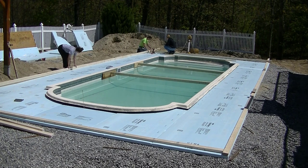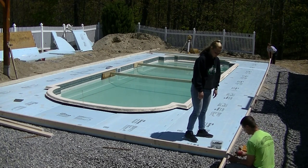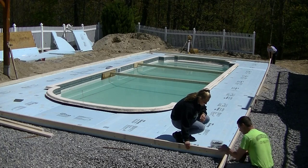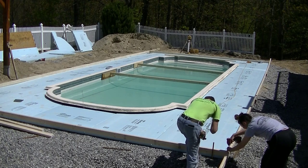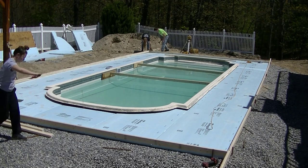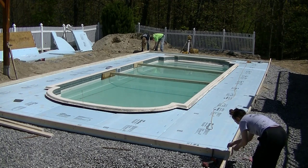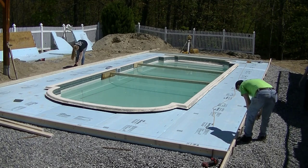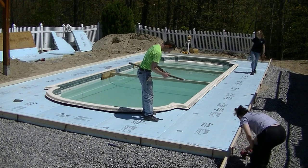We're pouring a four-inch thick - at least on average three and a half to four and a half inch thick - concrete pool deck around this thing. We're using two-by-fours for the framing, and right now I'm just getting everything put together. We're going to go about four feet wide with the pool patio around the pool - the pool was about 32 by 12 itself. I'm driving in the pins to hold the forms; we can fasten the forms right to those pins, which all have holes in them. I'll have a link for those pins down in the description - we use them for all our framing because we can either nail or screw right through them to hold our forms, which makes forming really easy.